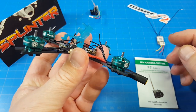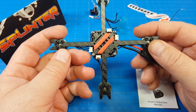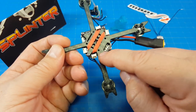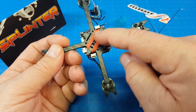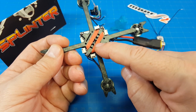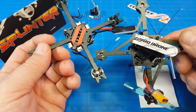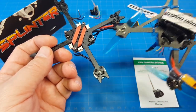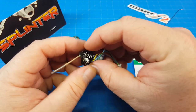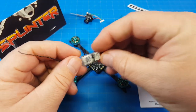I've got a slightly longer screw in front so I can increase the camera angle if I want to. I've mounted a rubber band on the bottom — I forgot to put my battery pad so I'll have to wiggle one underneath. With the Mode 2 you can do a traditional battery strap; I'd highly suggest the PyroFlip white battery strap — it's a nice one I've become a big fan of quickly. I'm using a rubber band in this case, which will add about a gram or a gram and a half to the build. The camera can be controlled via smart audio, which I'll wire to the board, and I've already pre-cut my receiver.